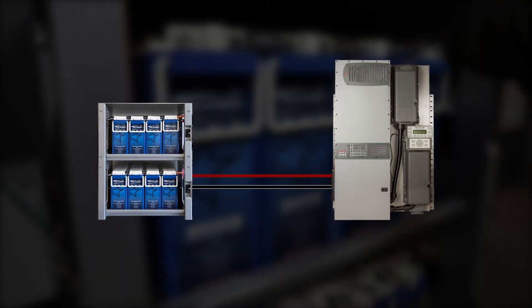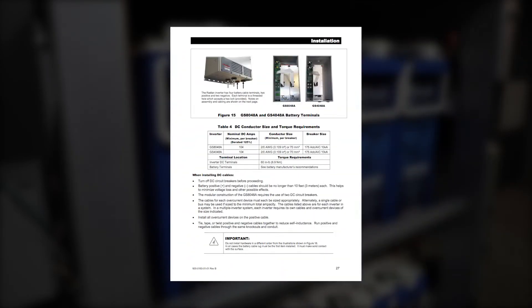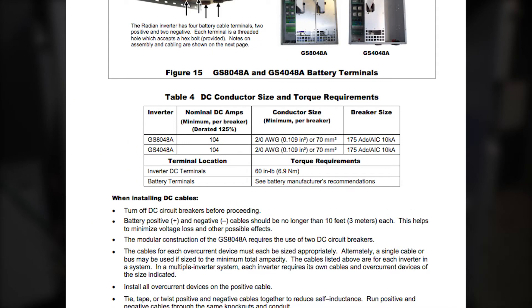Note: batteries should have a minimum clearance of a quarter inch between each battery for proper airflow. Ensure proper battery cable sizes are connected from each parallel string and home run to the inverter. Please refer to the inverter installation manual for recommended conductor battery sizing.